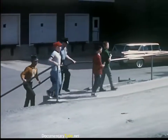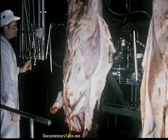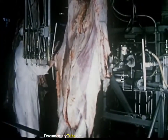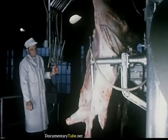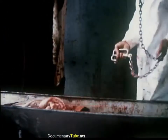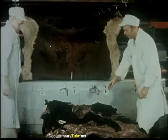Another area of the Hormel plant to be visited — the Rugg family is directed to beef operations. A modern on-the-rail dressing system moves the cattle to the mechanical skinner. Two long arms move outward and are affixed to the beef hide. This operation pulls the hide away from the rib area without scoring it or chipping into the meat. The remainder of the hide removal process is accomplished with a motorized chain that is fastened to the hide and pulls it from the animal in a clean and efficient manner.